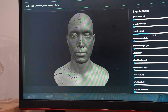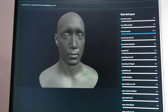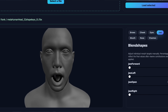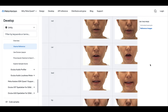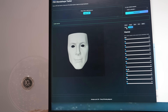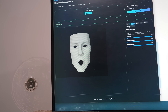Now that it actually looks like the magic mirror, we just gotta make it talk. Making a face look like it's talking was no easy task — I thought I could just move points in a model around, but that caused some cracking. After some research, I discovered Blend Shapes, which lets you rig a model and move all of its features. Just moving the mouth up and down doesn't actually look like talking — it kind of hits the uncanny valley. To solve this, we used a technique called Visemes, which are the shapes your mouth makes when you say different syllables. String these together and it looks like you're talking. I made a 3D model of the mask from the movie and spent a long time getting the mouth shapes for each Viseme, but it was all worth it in the end.